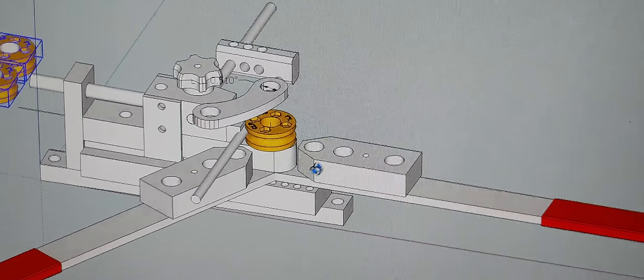This is my setup here for bending aluminum quarter-inch tubing and it's working just very nicely. With properly designed and properly sliced dies — these have a hundred percent infill on my Cura settings — so when I print this it's a solid die. I also have these indentations or pockets here for 4-40 bolts and nuts, done on both sides, and it has the markings for the one-inch length of curvature for a 90-degree bend.